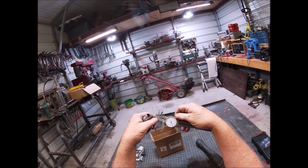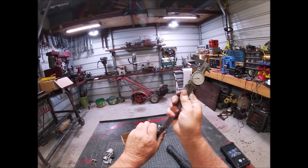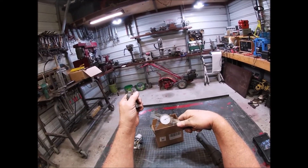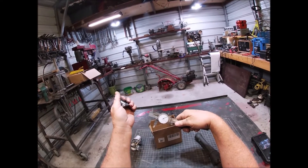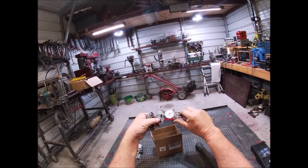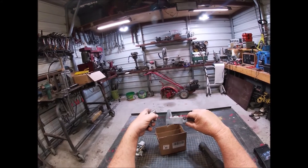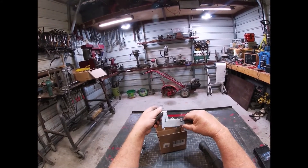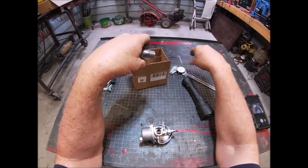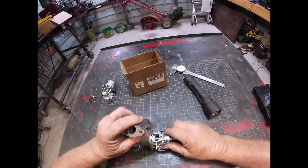Almost six hundred thousandths. That's about twenty-five thousandths difference. And in perspective, that's that much — that could be a lot. So what I plan to do is chuck this in the lathe and cut it back so it seats all the way down.